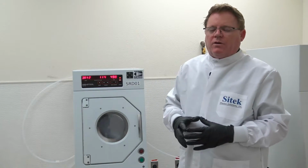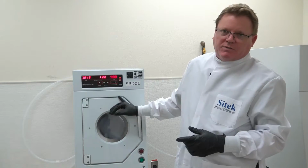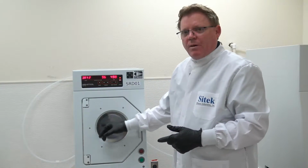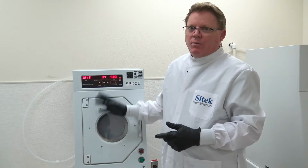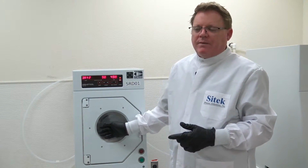We're the first controller. Our new slogan is it's the only spin rinse dryer controller in the world that pays for itself. Our payback analysis that we supply to customers is anywhere from 12 to maybe 16 months. Usually it's a lot shorter than the 16. What we can do, if a customer calls us and gives us their utilization rate, that means how often in a 24-hour period it's actually running. Not ready to run, running, because when it's idle, the N2 would be off while it's waiting.